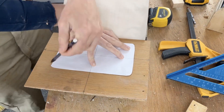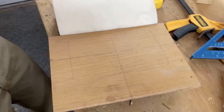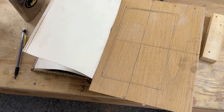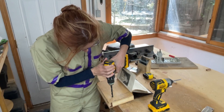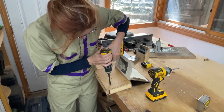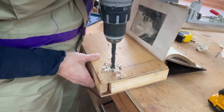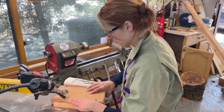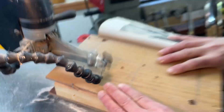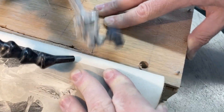I started by finding the center of the book screen with a template and sandwiching the pages between a couple pieces of wood, which I then screwed together so that they were nice and strong and firm. I used a drill to round out a couple of the corners, which are kind of the hardest part to do on the saw. Then I took it to the bandsaw and carefully cut all the pages out. This worked really well — they came out in a nice block and it wasn't that hard to do.